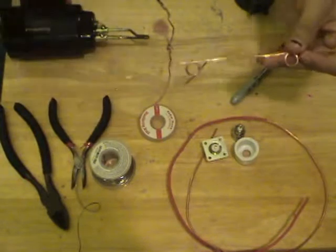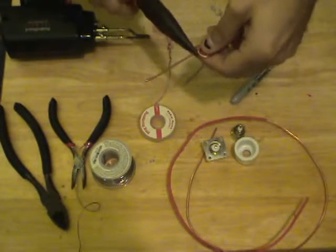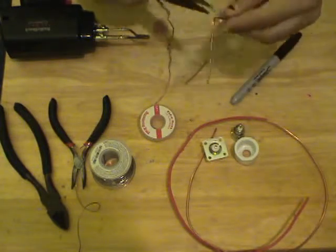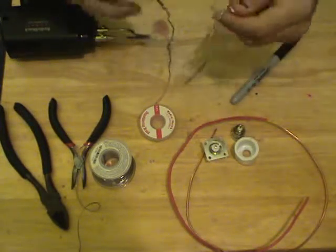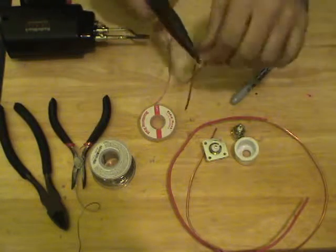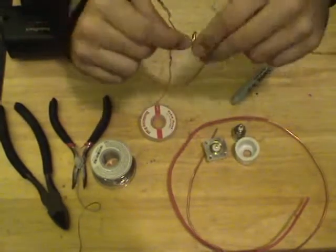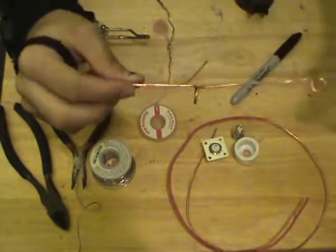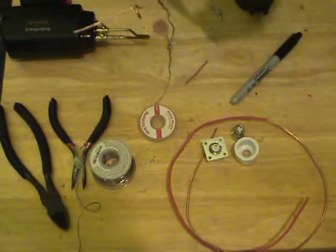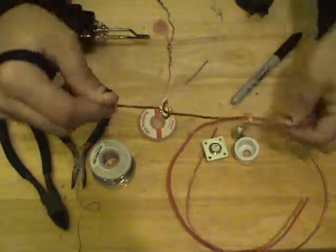And this is the meat of our antenna. What we're going to do is take some needle nose pliers and bend the appropriate length downward. Try to get these as sharp as possible — if you can't, no big deal. We're going to sneak this under here and give it a nice, sharp twist up. There's our first coil. Go into the second one and do the same. Got both of the coils placed — this is going to be the top end, this is going to be the bottom end. That's the meat of the antenna.